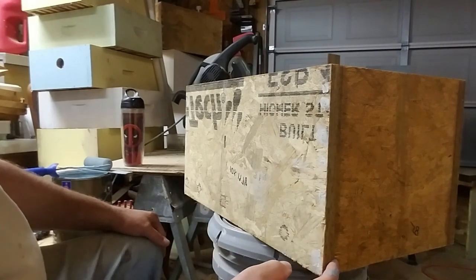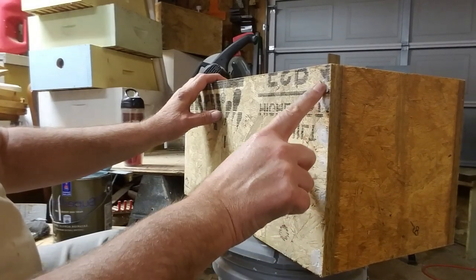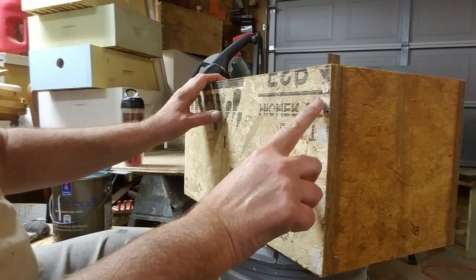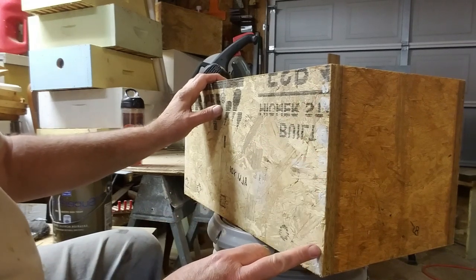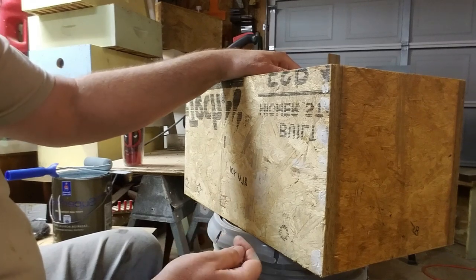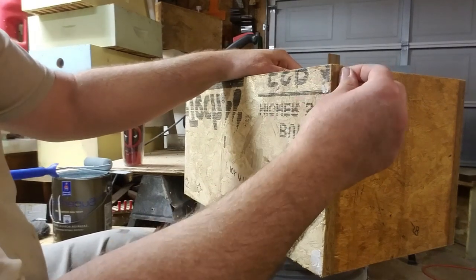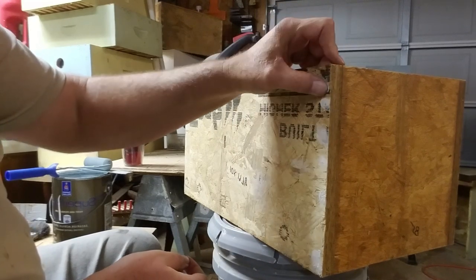I glue the seams. As you can see, I use a 40-year caulk and I'll caulk over the staple holes. I use quarter-crown inch-and-a-half staples that are coated — the uncoated ones will back out. I could take you out to the yard and show you some of the ones I did years ago where the gaps opened up, but if you glue and staple they won't come apart.